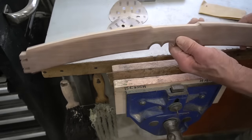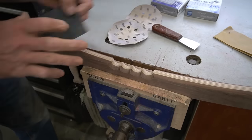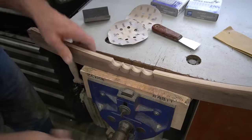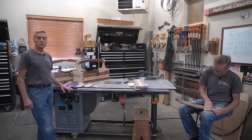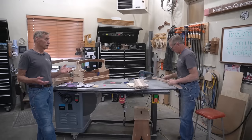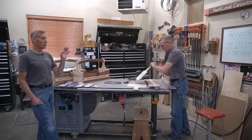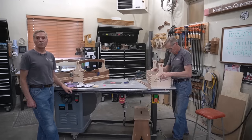And I can assure you that sanding the pistol grip portion of the handle works equally well with these techniques and products, but it's harder to capture on the camera, so I'll breeze over the bulk of the boredom here. And now that sanding on the handle is complete, Chip can slip that toolbox back together in an initial dry fit before glue up, and I'll proceed by making wedges for the wedge tenons on the ends of the handles, which I need for glue up.